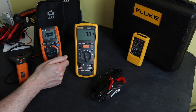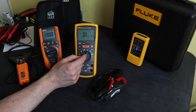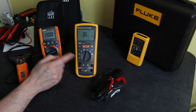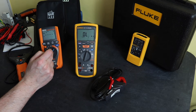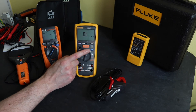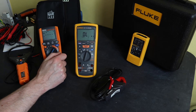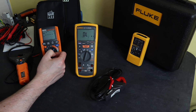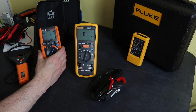For DC resistance, the Fluke has a standard resistance range. The HT Instruments has a standard DC resistance range that goes quite a bit lower, plus a 200 milliamp continuity function for measuring earth bonding and motor windings. However, there's no capacitance function on the HT Neptune, which is a glaring omission — capacitance is quite useful for industrial and white goods electricians.